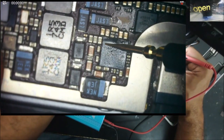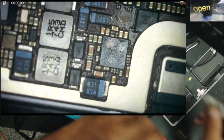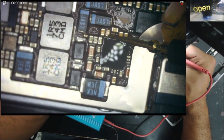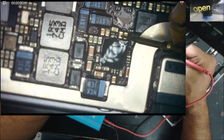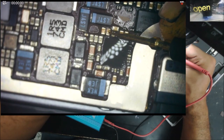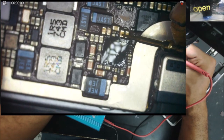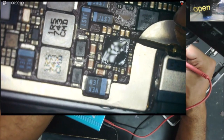So I'm going to inject the voltage over there and see if that chip is getting hot. The capacitor is getting hot, but it's not the chip. If I inject on this capacitor, these areas heat up — that's why it looks like it's the chip. The same thing if I inject here, you see this area, but that's not the chip — it's just because the capacitor is getting hot.